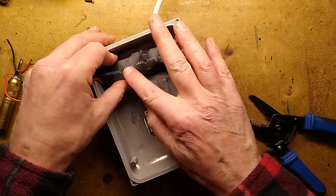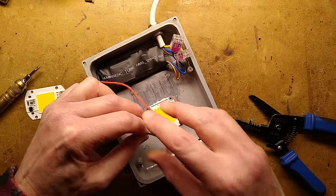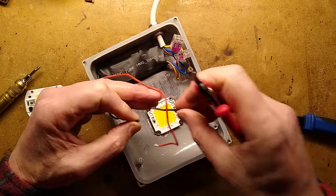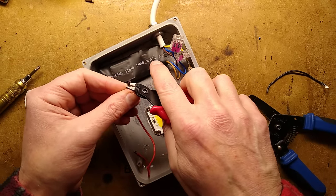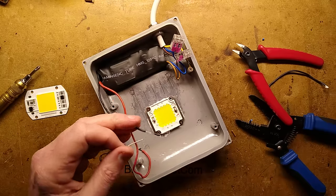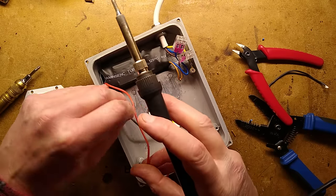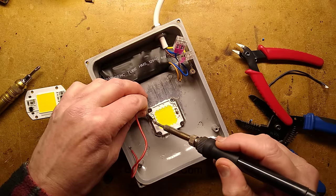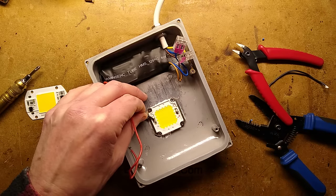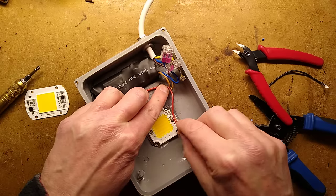It kind of fits. I trimmed a bit of the heat-shrink sleeving off. I'll trim these wires to size so they're not too long. It's soft silicone insulation, so I'll just nibble with my side cutters and slide that off. I'll solder and tin the connection — hopefully it is actually a tinnable metal. It's tinning — that's good! I'll pop that onto the LED. Soon, hopefully, the colour and brightness will be restored to the bench, because the brightness is really what's falling down at the moment.